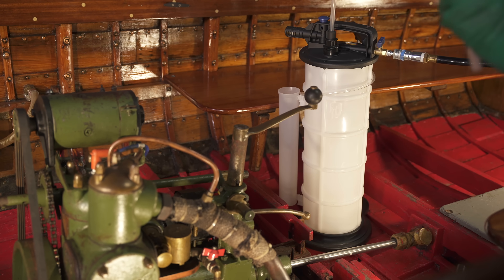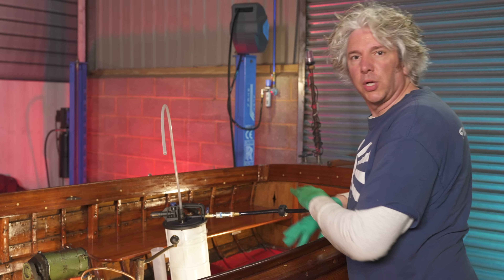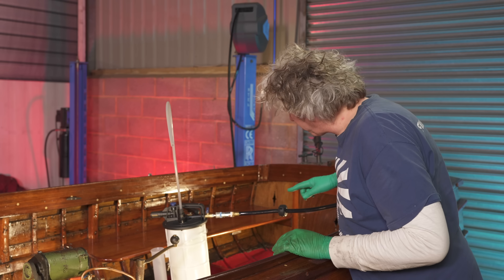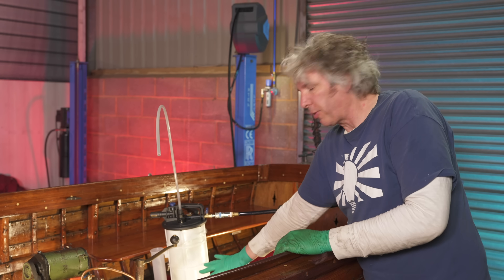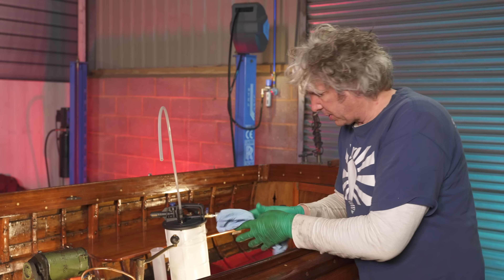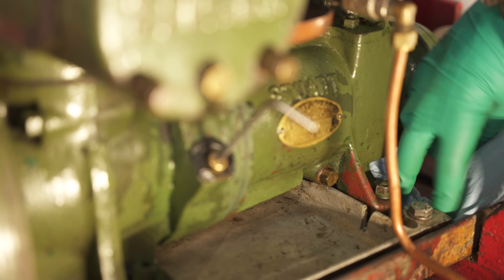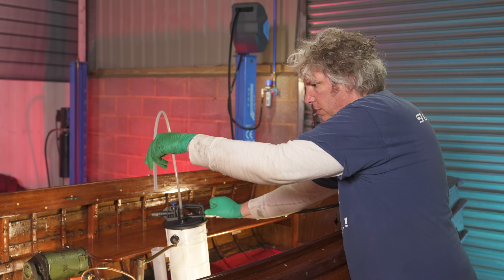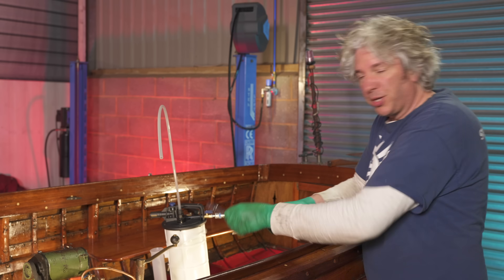Because of this little slot in the sump, rather than having oil go all over the bottom of the boat, I've got this vacuum device here. It works powered by air — compressed air rushes through, coming out through this little silencer at the end, and that causes low pressure inside the vessel, creating a vacuum, which means I can suck out the oil. I'm just going to pop down a little bit of paper towel just in case the oil does tend to escape. Now I'm pretty much ready to go, so I'll turn that on — we've got a vacuum going. Let's undo our sump plug.